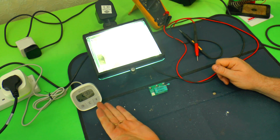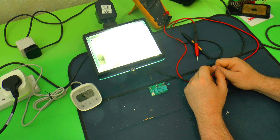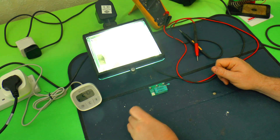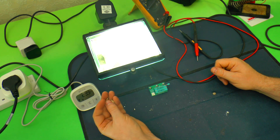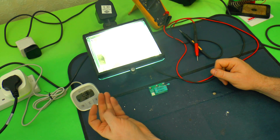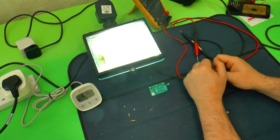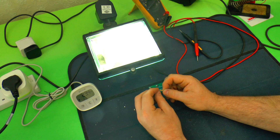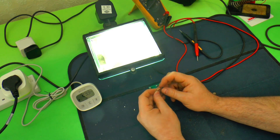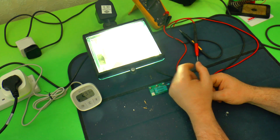For the sake of replacing two — in this case two 510K resistors. Now admittedly these resistors shouldn't have failed in the first place. You're talking just over one megaohm between the two, so at 340 volts it's only going to pass less than a milliamp. They shouldn't really have burned out. So it's a bit of a disappointment. It may be a bad batch of resistors — that's why they've failed. But that's where the problem lay: these two resistors packed in, causing the whole thing to just not be able to start itself running.